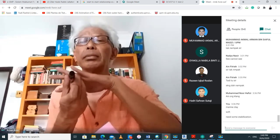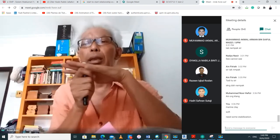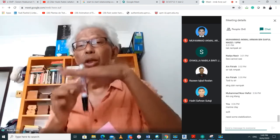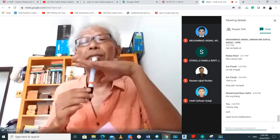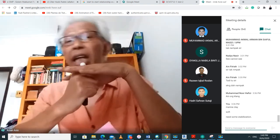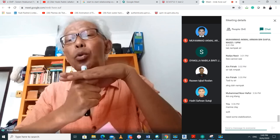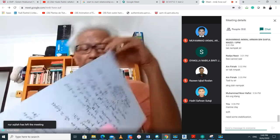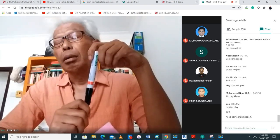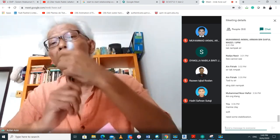Tip has an area, you see? So it's going to resist at the tip. Also, because the soil is sticking to the pile, when you push it downward, the soil is resisting it around it, and it's going to give you friction. So that's the other strength component of the soil, which resists the load or stress that you give in the pile. So that is why, in general classification, they talk about tip or end bearing pile, or they say friction pile.